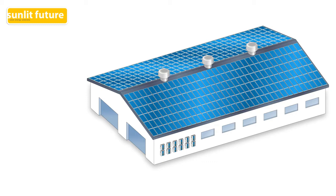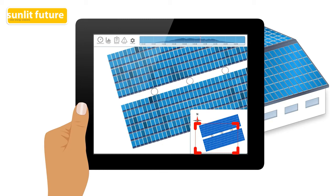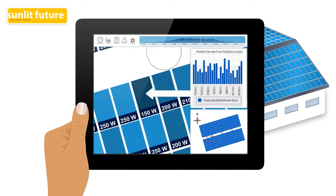Microinverters and power optimizers are also referred to as module-level power electronics or MLPEs. A great benefit of systems with MLPEs is that the performance of each panel can be monitored individually. The performance of each panel is sent to a database, and authorized people can log in to a website to view the status of the system. This is a great benefit for maintenance workers. They can remotely analyze the problem and come to the site prepared to perform the maintenance.